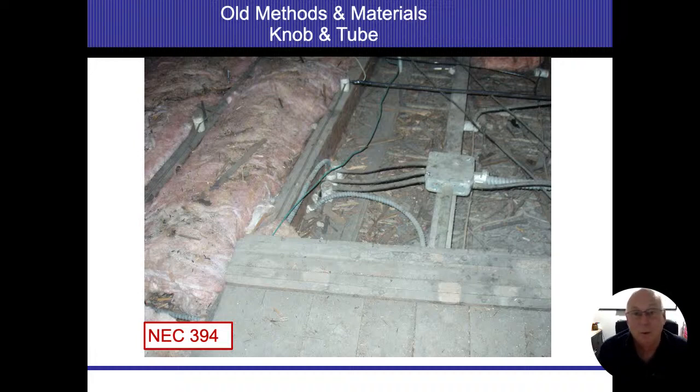But this stuff is old. This is turn of the century, 1900 old, and it's all out in the open. Some of it you'll find in conduit as well, when they merge newer systems into it, but it's all old. It was all subject to damage and overheating, and we just do things with the plastic insulation so much better. So I would continue on asking my client or recommending that they check with their insurance company. But nonetheless, I'd like you to know some of the rules, and where they get the names and everything else from.